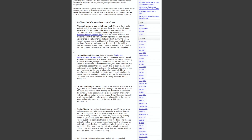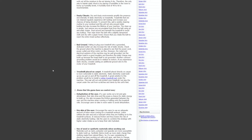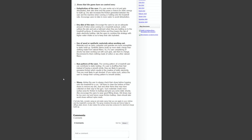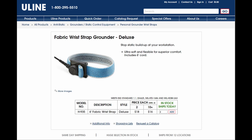Knowing a little bit about electricity — certainly not an expert in the field — I know that to dissipate static electricity, I need to conduct to a lower potential. The casing of the treadmill is a bunch of grounded metal. Great — zero volts. There is a product called a wrist strap used in electronics to prevent static electricity from building up in people when working on electronic products. My plan is to mimic this technology and implement it into the already required safety strap.